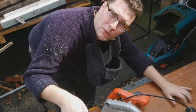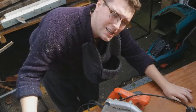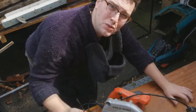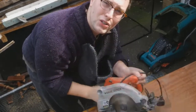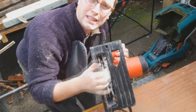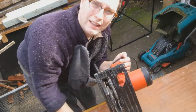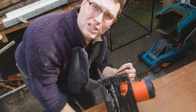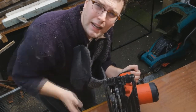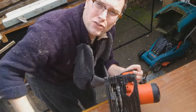So this is my chipboard — it's an old piece from a wardrobe we got given and I'm going to cut it to size. I need to measure it out to be 75cm but my circular saw has a three centimetre guide between the guide and the blade, so I need to subtract that off. I actually need to measure out 72cm, then put a guide on here and cut that off.